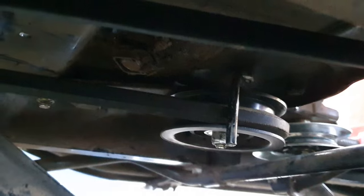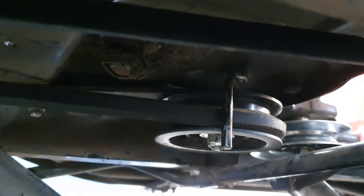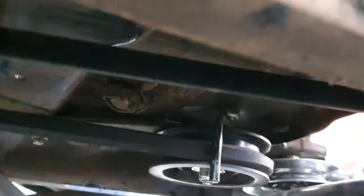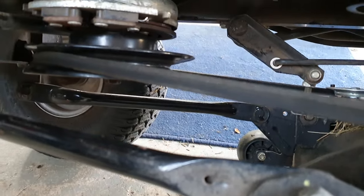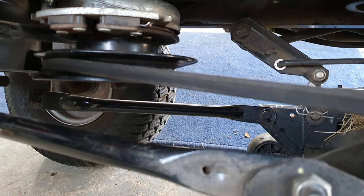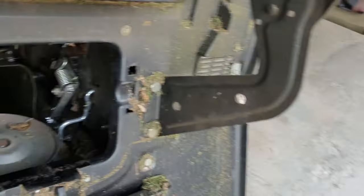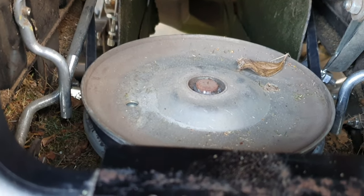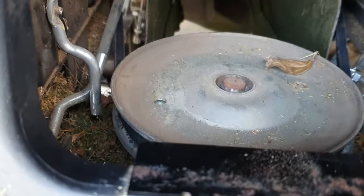That is the mechanism that disengages the drive — it just allows slack in the belt for it to slip. As you can see it's got a guard on it; that's another 13mm bolt you'll need to undo to get the new belt in. Then it's just a very simple reversal of all that. Putting the deck belt back on is very simple — just put it on how you took it off, get it halfway around the pulley and twist the pulley by hand to pull the belt on. For the back, leave the final bit of the belt off, then get your foot on the clutch mechanism to introduce some slack into the belt and you'll be able to quickly put the belt on.